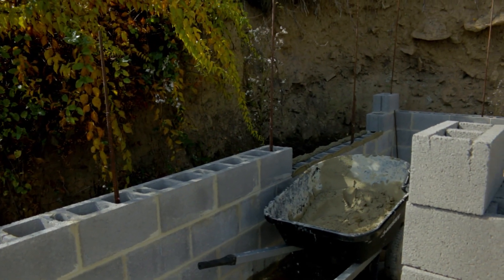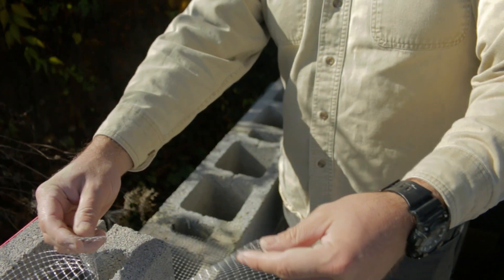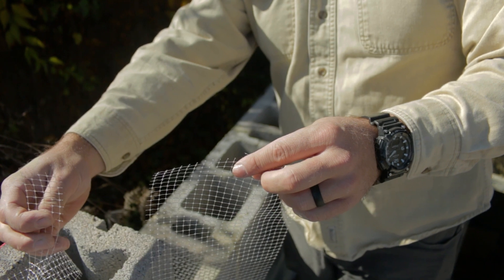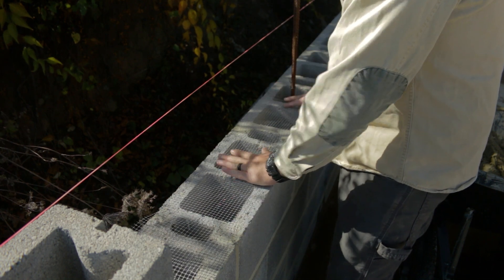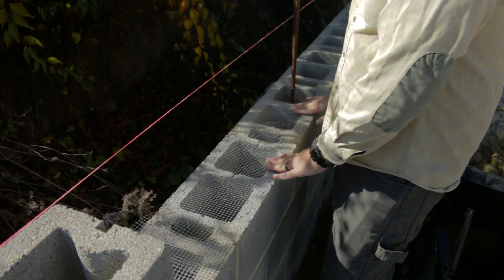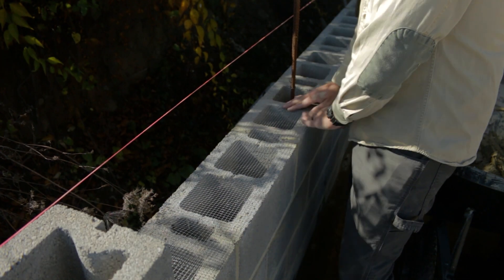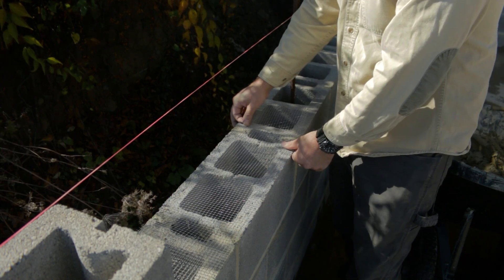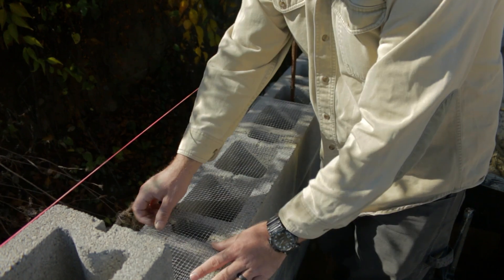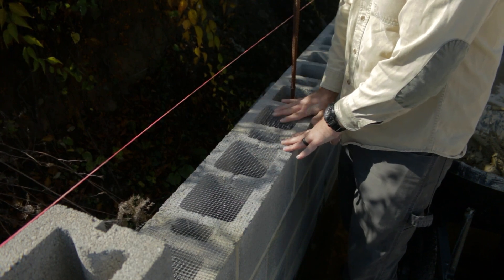So what we got here is our grout stop, and this is how much we've been trimming off — about an inch, maybe inch and a half. We're going to lay this down here on top of our course. We don't want it to penetrate down through this one. We put it down on our corner one here already, so we're just going to butt up to it here and come back to this one web here because we want to fill this core. We're going to stop right here, keeping it in probably about half an inch from either side. All we're going to do to keep this in place is just trowel some mud down here, and this is going to be set to go.